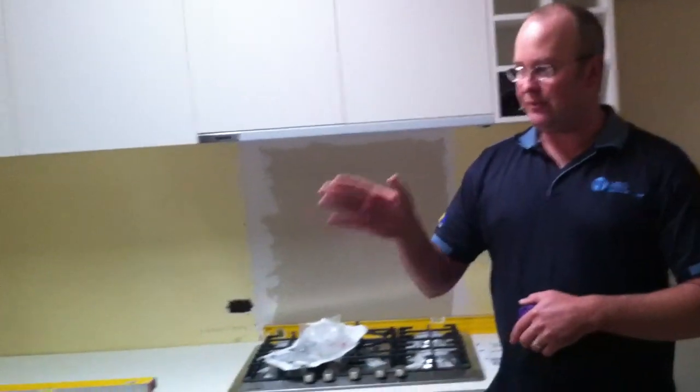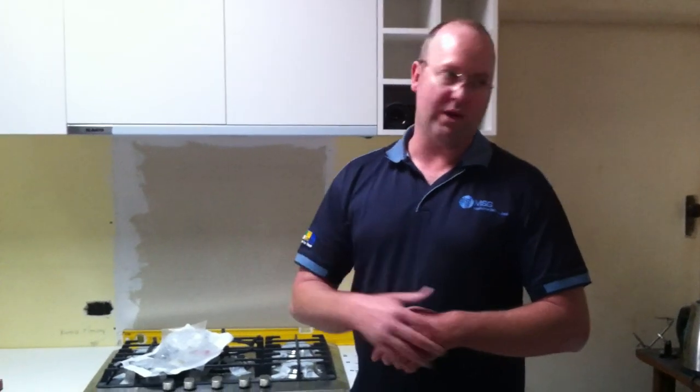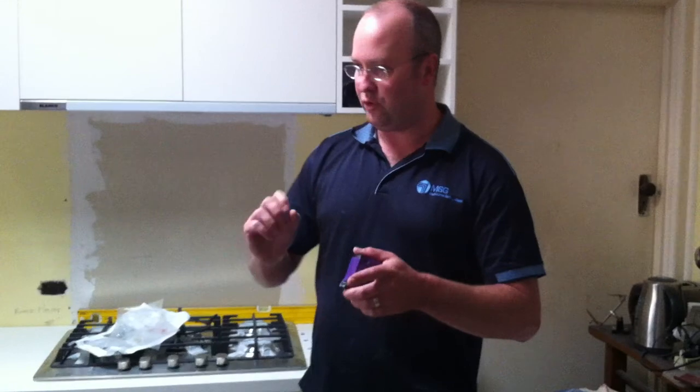And you put a radius on those internal corners? All glass, when it goes through the toughening plant, must have a radius the same thickness as the glass. So 6 mil glass is a 6 mil radius. Otherwise, it won't go through the toughening plant. It doesn't twist and warp, it fractures. It's a weak point. You can't have a square internal cutout on glass.